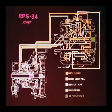When the selector lever is in low, the selector spool is positioned to engage the C1 and C2 clutches. Pressurized oil is directed from the selector spool into the C1 pilot circuit, which is routed through the reverse lockout spool lands. The C1 pilot is actuated, permitting pressurized oil from the supply gallery to pass through the pilot and into the C1 clutch.